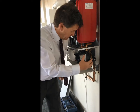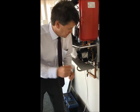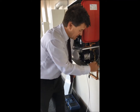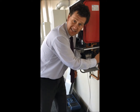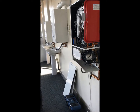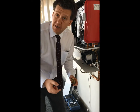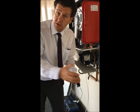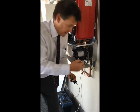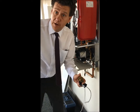But let's say the pump is running but you're showing a low water pressure on this boiler — it's a 28 code, you're showing low water pressure. Then it could be the low water pressure cutoff switch or the pump proving switch. As you can see, this wire's in sequence so you can't actually link this out. Nine times out of ten it's not the low water pressure cutoff switch that's faulty, it's the level of debris that's sealed off the pipe — it's a dirty system that just needs cleansing, cleaning, or a power flush.